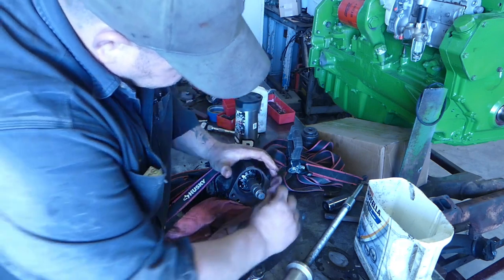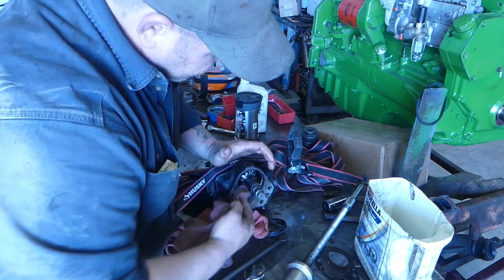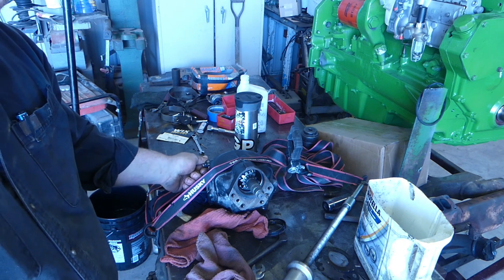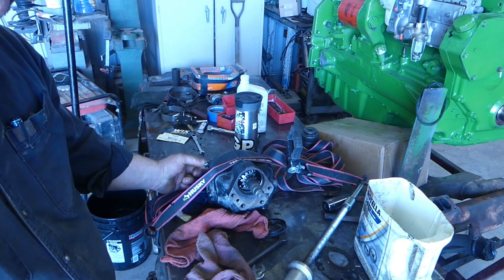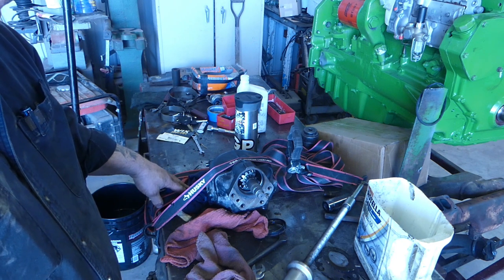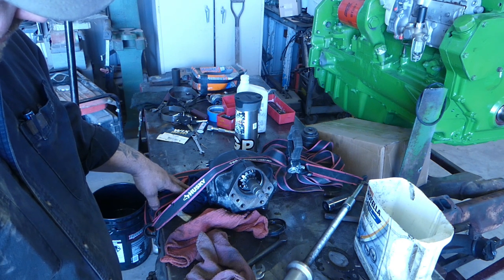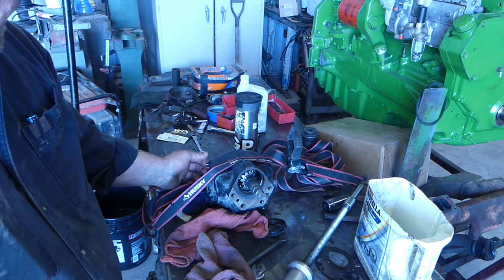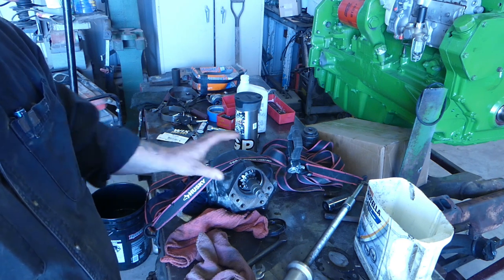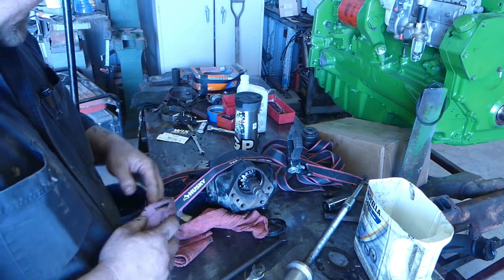I did take it to the parts washer and cleaned everything on it, so it is clean. It's good to go. I drained it out of the drain plug down here. The customer did ask me if I could look for a breather, and I don't think this axle has a breather, to be honest with you. I'll have to look and see, but it did have a little bit of pressure built up in it when I pulled it apart, so it may be causing the leak to be more. We're going to head out there. I'm going to clean up that other part